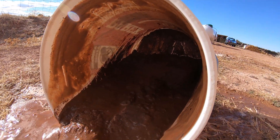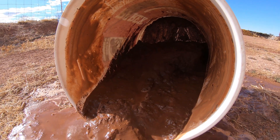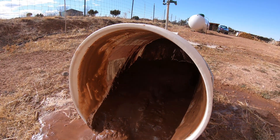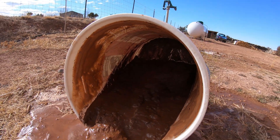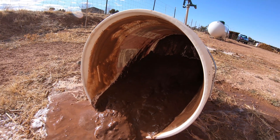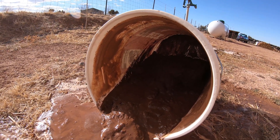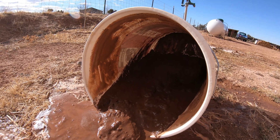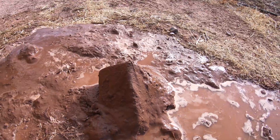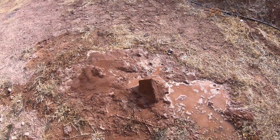After dumping all the water off, the mixture has completely eroded and deteriorated away because it had no Portland to hold the block together. That is zero percent — no Portland. That's the danger if you decide to build block like this. I highly strongly recommend that you put Portland in your block. That is all that is left of the block with no Portland — one small corner.